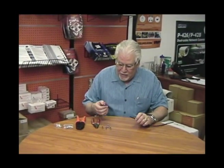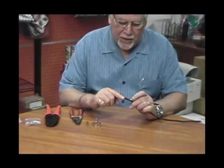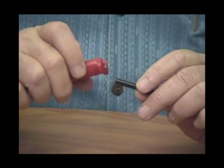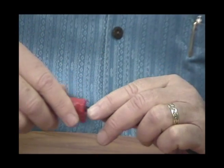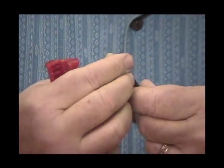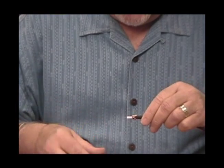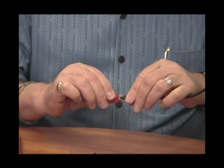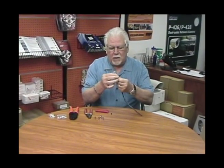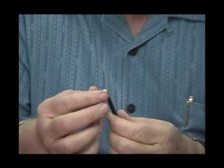First thing you need to do is prepare the cable correctly. With crimp BNC connectors, you need to expose a little more of the center conductor. I'm going to remove the outer jacket — pulling off about a half inch to expose the braid. Then I'll pull the braid down with my fingers, reverse the stripper, and cut back the white dielectric, exposing less than an eighth inch so the center conductor is visible. Make sure none of the braid touches the center conductor, or you will have a short.